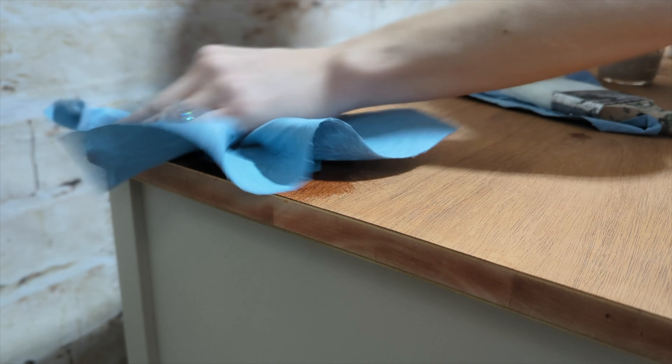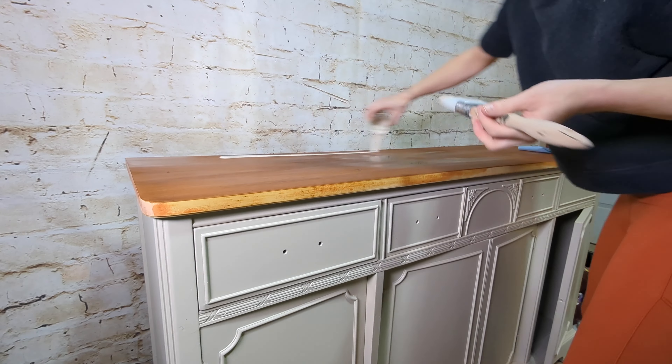I tested the color by mixing two of these stains together, then decided I wanted a little bit more of a wood tone in it because it was pulling pink. So I mixed a third one into the batch as well — it's in the description. From here I mixed my stain up completely and wetted the entire top surface.